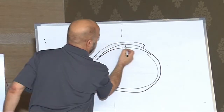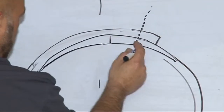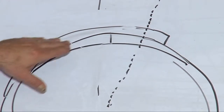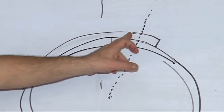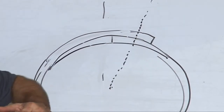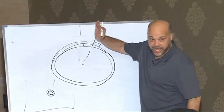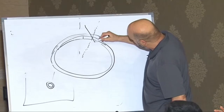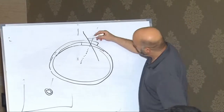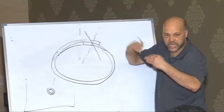This is void. This is the end of the tape. And this would be perpendicular to the tangent of the circle at that point, if you remember your geometry. Now, instead of cutting it that way, the top part needs to be shorter and the bottom should be shorter that way — that would allow them to fit. So what I do is I take my razor and I cut it at an exaggerated angle. I angle the blade towards where the tape is coming from. What that does is it shortens this distance, and when I push that tape in there, it goes perfect.